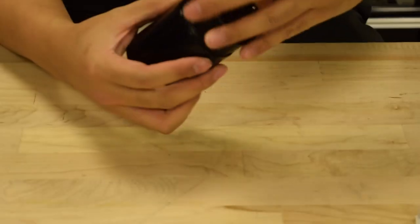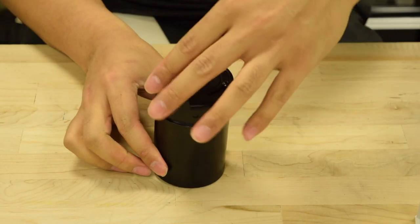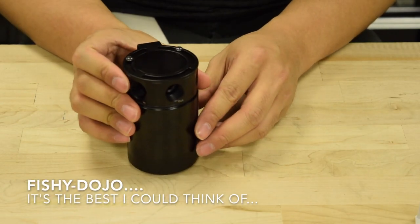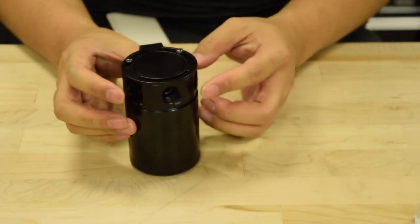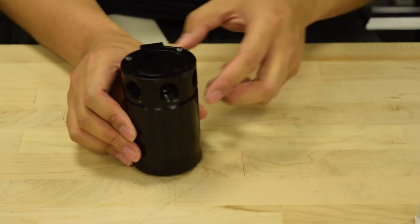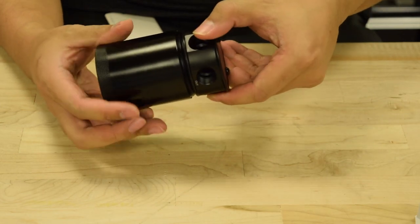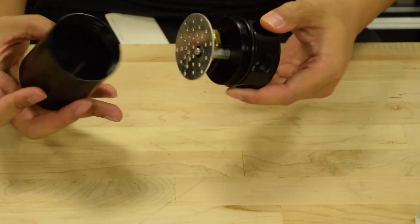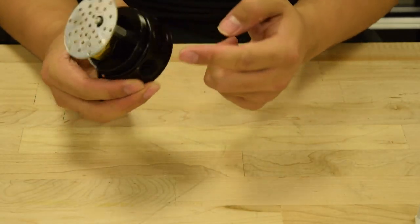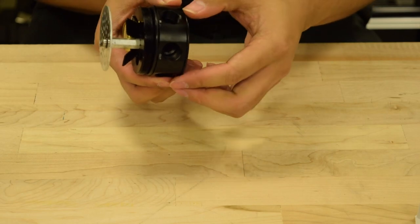Here I have a can that I found for $20 USD. It's a very similar design to one being sold by a retailer for over $100 USD — that retailer's name rhymes with fishy dojo. This comes in a 2-port or a 3-port option. I opted for the 3-port with 2 intakes and 1 outlet. If you take a look at the inside, you'll find that there is very weak baffling in the form of 2 flaps, and the filter media is at the very end of the air's route right before it hits the outlet.